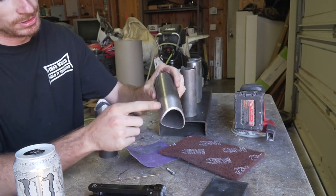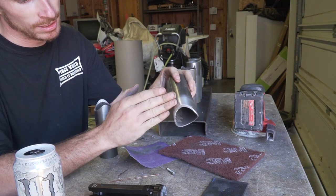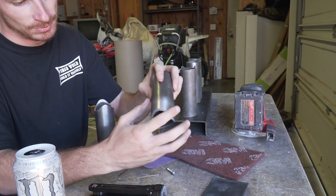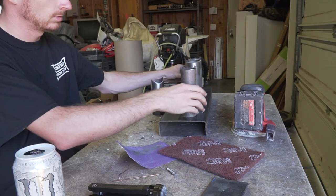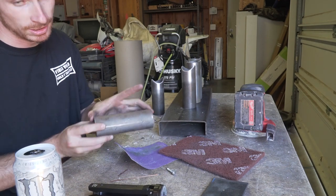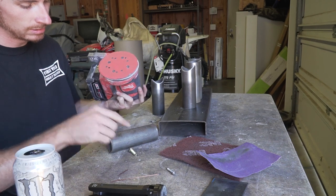You don't need to do the whole section of tube - you only need to do a small section, and even this is overkill honestly, unless you're going to have another tube land somewhere right here. I usually go about an inch to an inch and a half past where I'm actually going to be welding just to make sure everything's nice and clean. On the flat section of tube I'll go ahead and clean the entire thing because I don't know exactly where I'm going to land it - and on a section as small as this, it's easier just to do the entire thing. So for this I'll use the orbital sander and go ahead and clean this whole thing up.